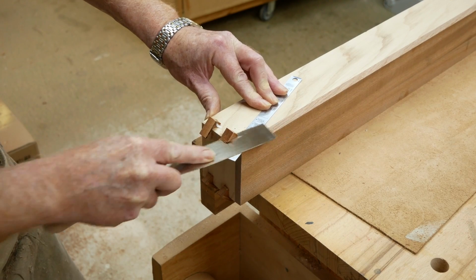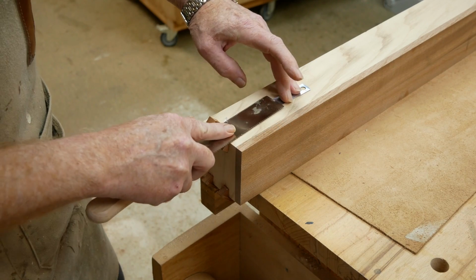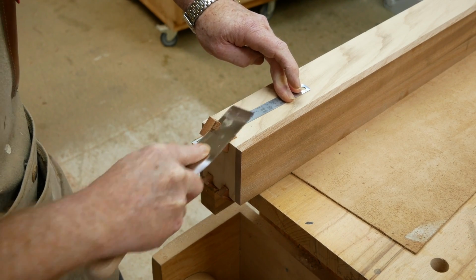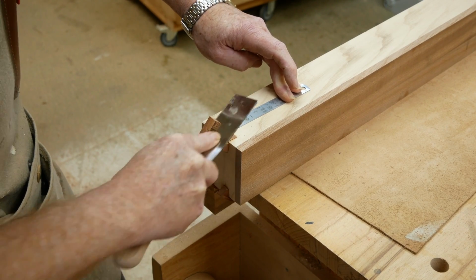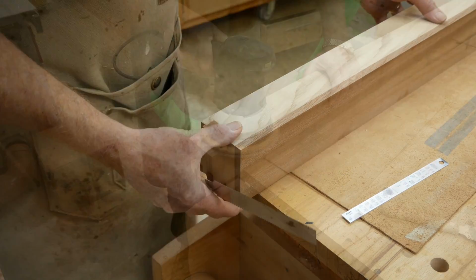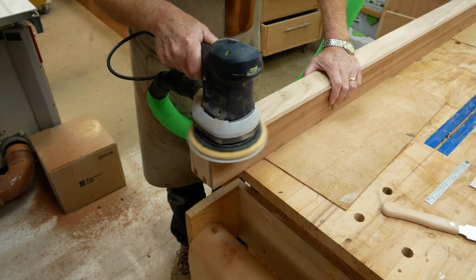I'll cut the excess timber off from my dovetail splines using a flush cut saw, and I'm going to be using the back of my Shinwa 150mm rule. Incidentally, the best rule I've ever bought. Check it out, I'll put a link below. I'm going to use the rule just as a standoff to make sure that I don't scar the surface of the box. Then I'll just sand off the little nib that's left with a bit of 180 grit.